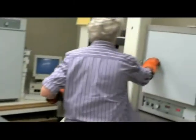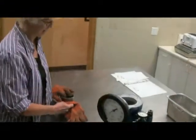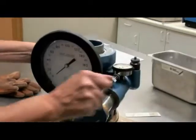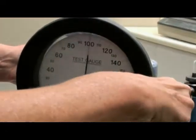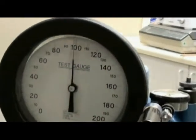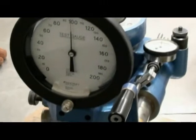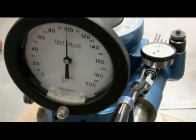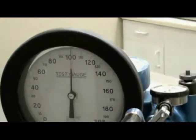Place the follower back in the oven and get the thin-walled cylinder out — the calibration cylinder — and place it into the stabilometer. Then you're going to turn the horizontal pressure to 100 PSI and once again allow it to stabilize. Simultaneously, you'll be adjusting the turns displacement dial to 0, so it takes a little time for everything to stabilize.